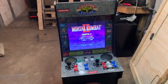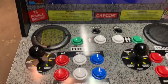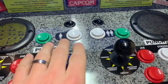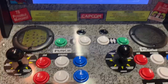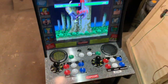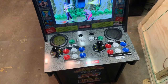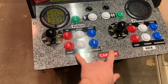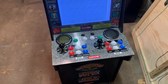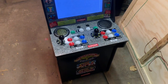On the front of the cabinet, I added a speaker so it's now running in stereo instead of mono. I also had to add select buttons — these green buttons were added afterwards because you need a select button, which also acts as the coin insert button. There are USB keyboard encoders underneath the control panel that all the wiring for the buttons and joysticks plug into. The encoder outputs to USB, which gets plugged into the Raspberry Pi.